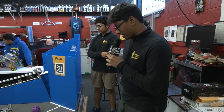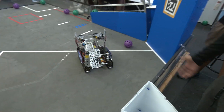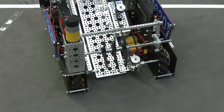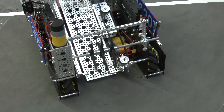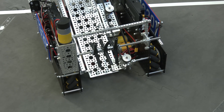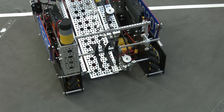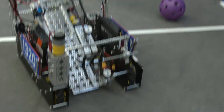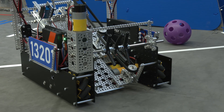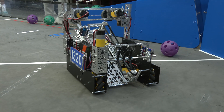Hi, I'm Caleb, part of team 13201 Hazmat. Here's our robot — we have a roller intake on the front with surgical tubing, a 435 motor on it, and it's able to intake the balls pretty fast. It holds all three balls on our ramp system. A past iteration had the shaft mounted low, where the ball would climb over the shaft and roll on belts going up, but instead we changed and mounted it upwards, which allows us to keep the balls held on our ramp system in place for our shooter.